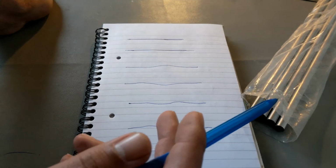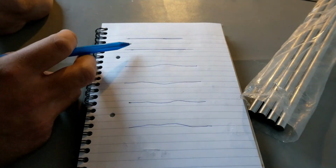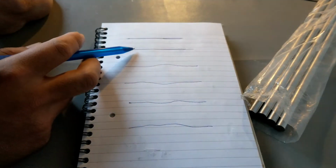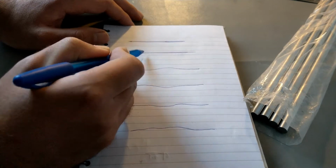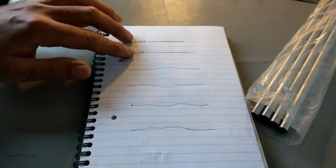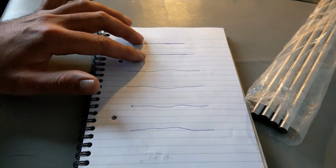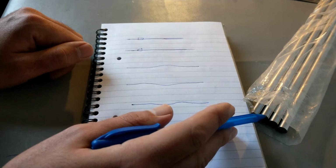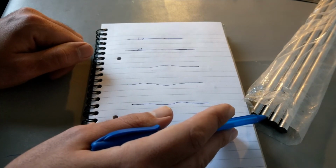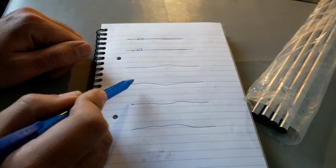In most machines or applications, these linear shafts are used in parallel. So let's say we want to use them for the 3D printer bed. Each of these lines is, let's call it, one linear shaft. Basically, when the bearing is placed on these shafts, they travel an equal distance, and the gap should always be the same. On this linear bearing, the worst one was almost about 1 millimeter of run out. And your shaft looks like this.